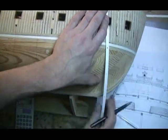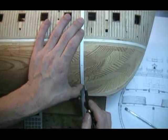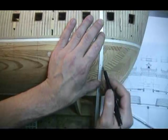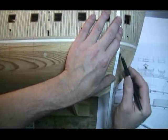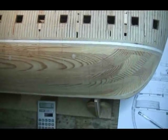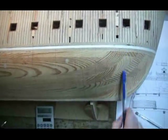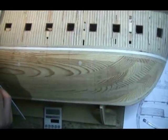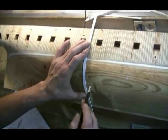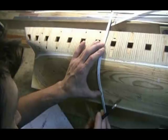Moreover, the more complex the hull lines, the more often these lines must be placed. The more difficult the surface of the hull, the more often we must put the lines. More closely. If this is very, very blunt, more lines. More than every frame, maybe two per frame. Two instead of one is necessary to put in the difficult places. Here I apply this marking.